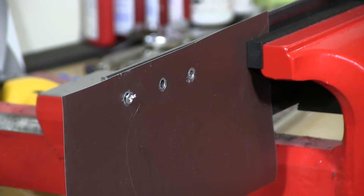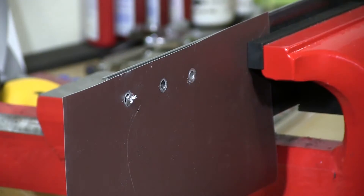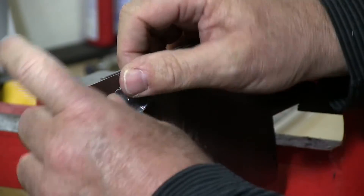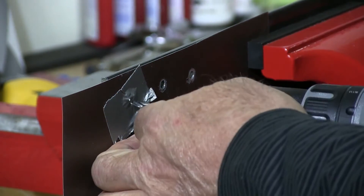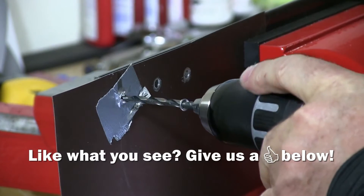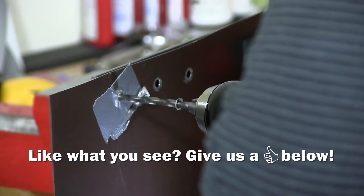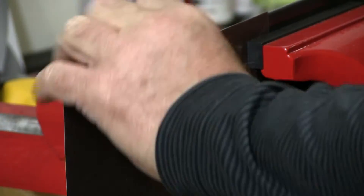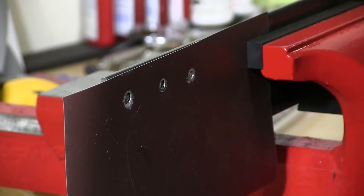I'm going to take a piece of duct tape. It will be even better than blue tape if the rivet is stubborn and wants to spin out on you and you can't get enough pressure on it. Take a piece of duct tape, put that baby on there, find the center — out it goes. Take the duct tape off and the rivet is gone.